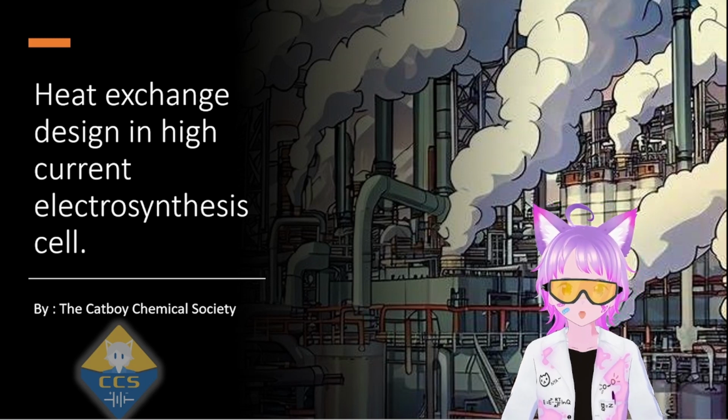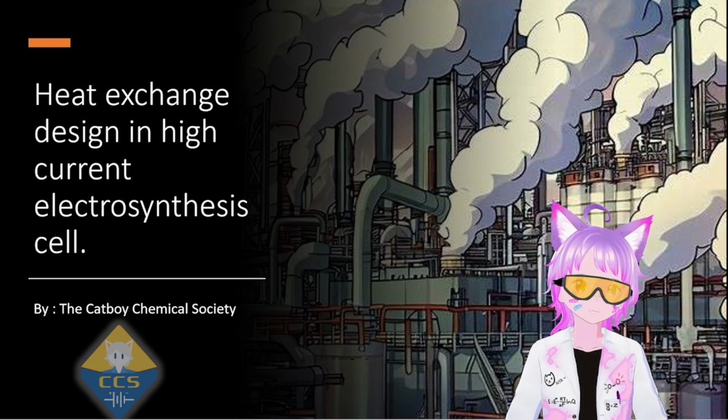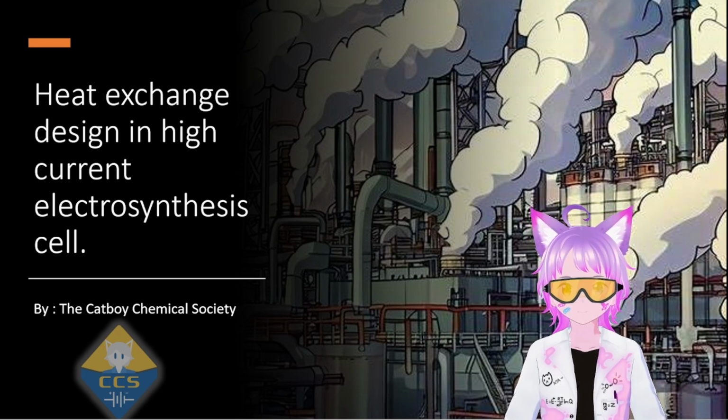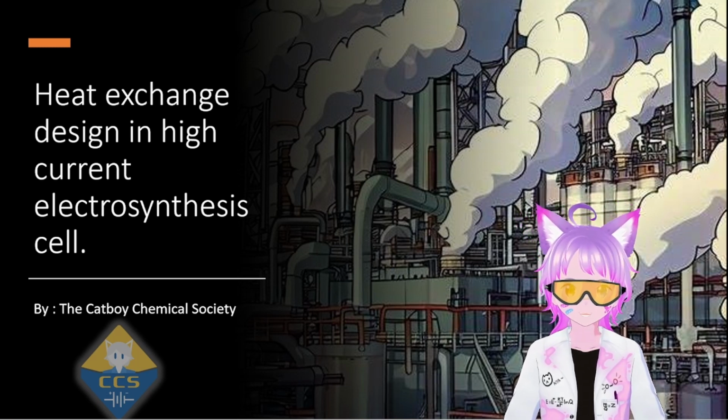So this video is about how to design high current electrosynthesis cells, like chlorate cells, perchlorate cells. When you run anything higher than 20 amps, maybe 50 amps, you're gonna need to cool that thing. Because if you don't cool it, then you're gonna have problems with your electrodes or process. Sometimes you might even wanna heat it up. It all depends on you.